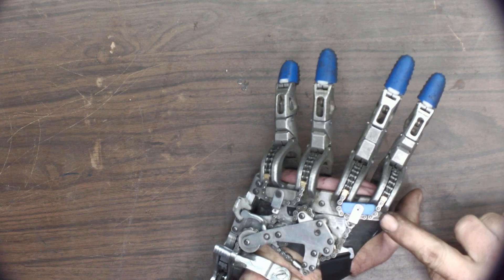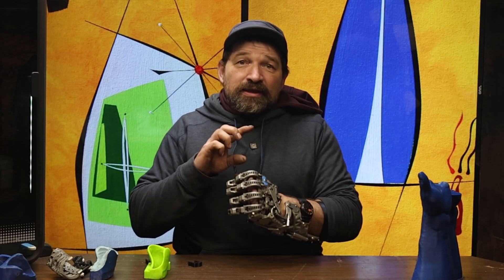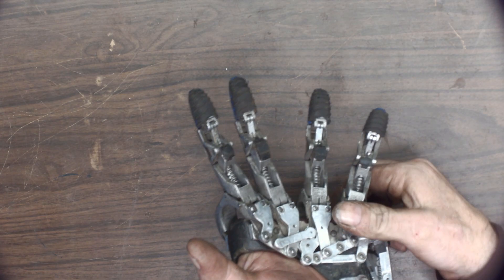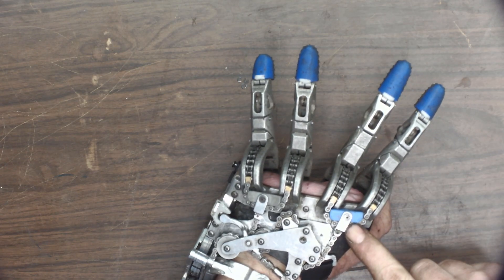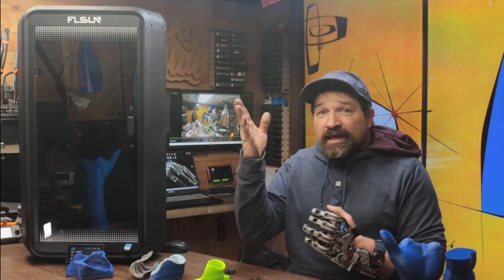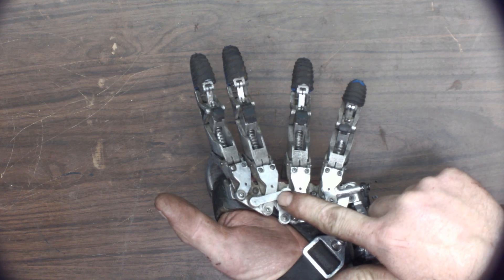So I started working on a plan to redesign the device in a way that would require the fewest number of custom parts to accommodate his situation. Right now, the plan involves modifying the mounting rails, the winder, and the splay mechanism. What I'm going to do is remove the index finger placement on the top and bottom mounting rails and move the index, middle, and ring finger down one position, eliminating the pinky finger. Since I'm now doing three fingers, I need to get rid of the index-middle whiffletree slider, redesign the upper and lower mounting plates on the winder assembly, and add a roller to them to get the chain to line up with the new index finger position. The splay linkage also gets a new driver plate and mid-link for the index so that the ratios all stay the same when the fingers open and close.